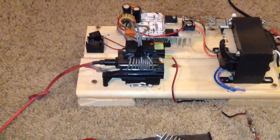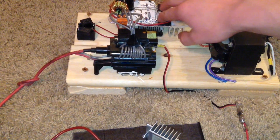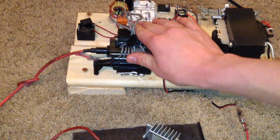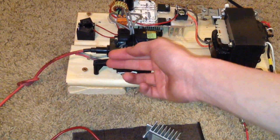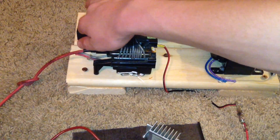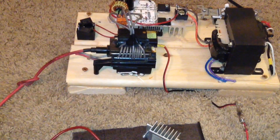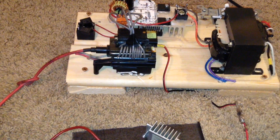If you look here, this is the driver. The heat sink is fairly cool — the MOSFETs aren't even hot. But the flyback transformer is warm and the windings are hot, which signals that I need to use more high amperage wire. The capacitors are extremely hot and are almost melting the hot glue, which means I'll have to wait a little bit before running my ZVS driver again. The heating problem, as I previously discussed, can be fixed by making a bigger capacitor.